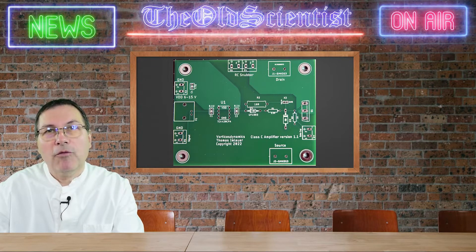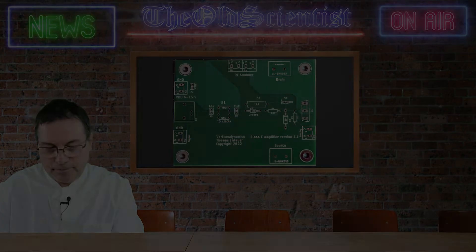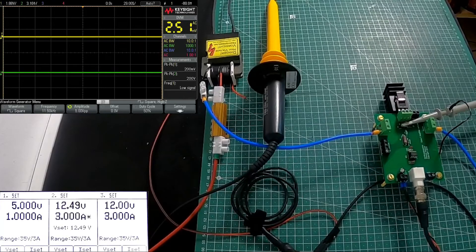I will also demonstrate that if we add a diode to the load we avoid getting hit by the back EMF. It does not dissipate the stored energy in the coil, but in resonance circuits we can't add a freewheeling diode — this works well only in switches, relays, or motors. Let's have a look at the demonstration table.